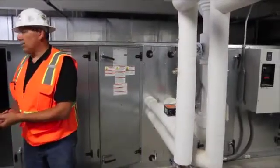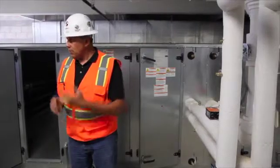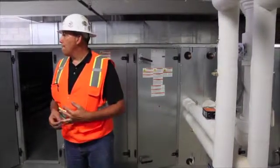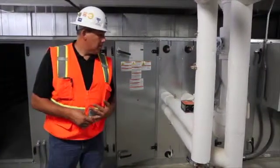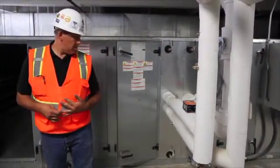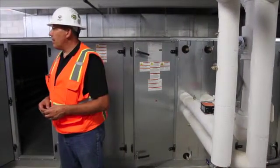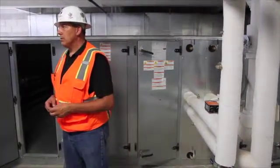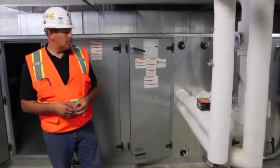This is very similar to air handler two, which is to the east. You have two air handlers. As for strainers — I don't think we put any strainers on them based on our detail, because this is off of the campus chilled water loop. So no strainers.